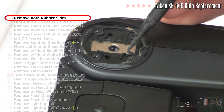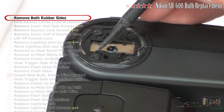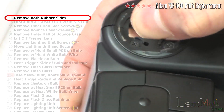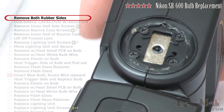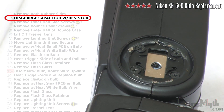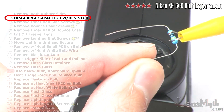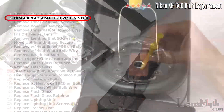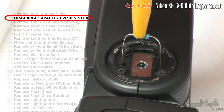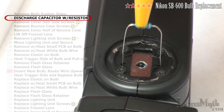The flash is still adjustable without the rubber button by pressing here. Set the flash bounce to 90 degrees and lay it on its side with the bounce adjust button facing up. You must discharge the capacitor. Get your resistor and hold it with a tool. Insert each leg of the resistor into the provided holes to discharge the capacitor. This will prevent shocking and arcing during disassembly.